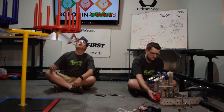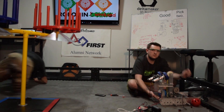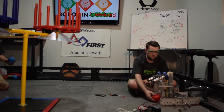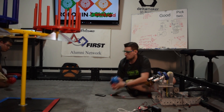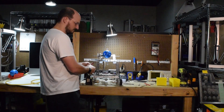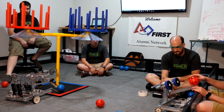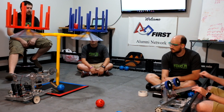We prototyped and tested the wheeled shooter. It was maybe a little less consistent, but not significantly less consistent than the flicker shooter. The integration into our design made it a better choice because the flicker shooter required the ball to get in a pretty specific spot — you had to index the balls and time it with the flicks coming by. With the wheeled shooter, you just have to get the ball up to it and it'll grab it and throw it where it needs to go, which integrated really well with the vertical elevator we built.